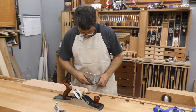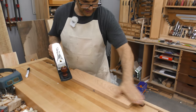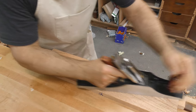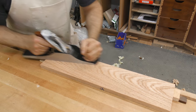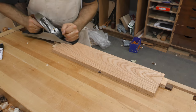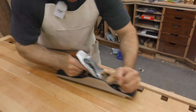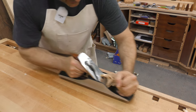Now we're ready to take that tape off. By the way, this was the easy part — the hard part is going to be reading that thin marking gauge line. On some wood that's easy to see, but with oak being as coarse a grain as it is, you almost have to get the light just right in order to see it. I think I'm going to take 32 seconds and sharpen this blade so I can get that perfect finish. Okay, new blade — I've got to do the same thing I did before and verify that the blade is parallel to the sole. With it fully retracted, I'll start planing and watch to see where that first bit of shaving comes out. Seems to be across the width, maybe just a little heavy on the left. What a difference a good sharpening does — you got to love it when shavings like that come out. That's what makes this so fun. With a thickness planer we'd do it a lot faster but it's noisy and dusty.